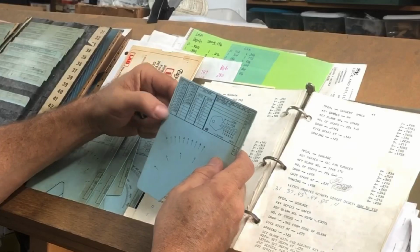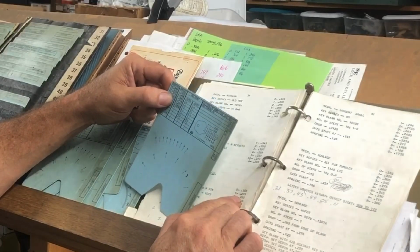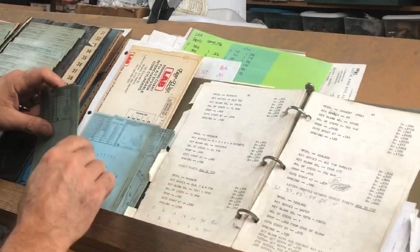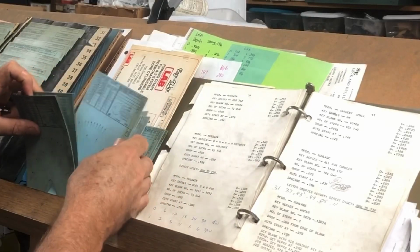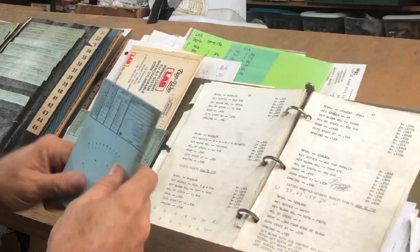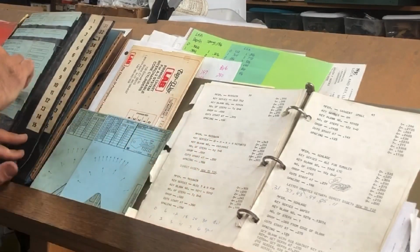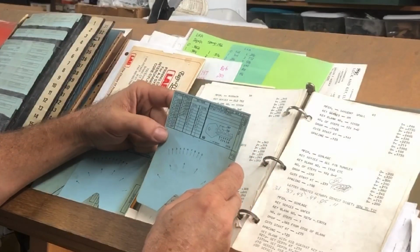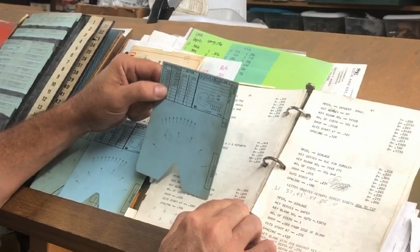We do have 9 depths again here. Let's match up these depths, which would be 305, 285. There's nothing even very similar on that, which is why I would say for rough work, like we were talking about, we would want to go, wait, that was Yale. No? Yep. We would want to go with the large pin standard. You could also come over here and look at Corbin old large pin, and we see it has 3s, 305, 291, 285, 277.